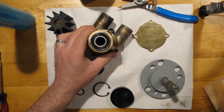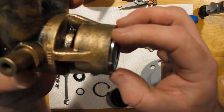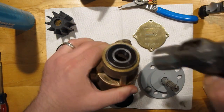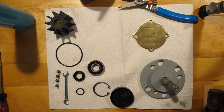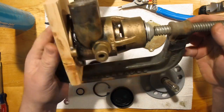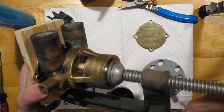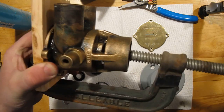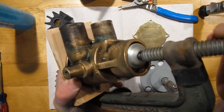What can happen is the ball bearing can try to go in sideways, and you don't want that. I just tapped it gently to get it to line up nicely. Now that it's good and seated, we should be able to press it in with a C-clamp. I've got a fairly large C-clamp, a piece of wood to protect the housing, and a big steel washer on this end. We can just push it right in — and in it goes. There are two of these, so we're going to do this twice.